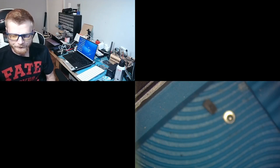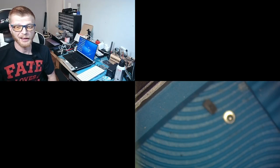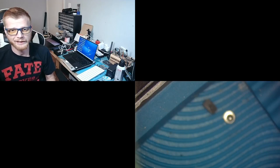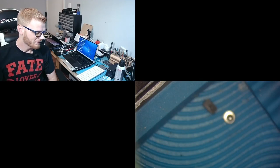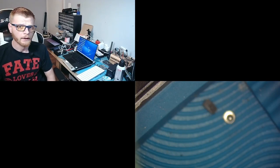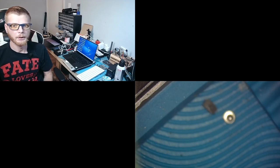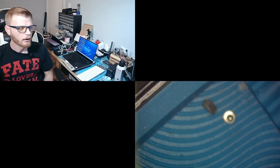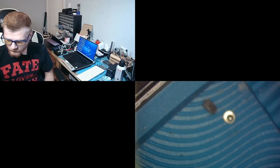I did the one, and I did that one because it's an A1466, which is like the easiest MacBook to repair. You don't even need schematics really for it. It's just kind of bop, bop, bop, and you're done. Like I was mentioning earlier, if you're trying to learn MacBook board level repair, definitely start on that board. The board model is 820-00165, but the model it comes in is the A1466. Really a fantastic board to learn on, so I highly recommend that.